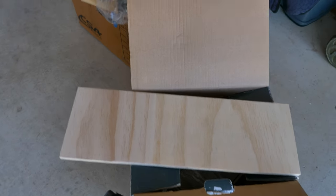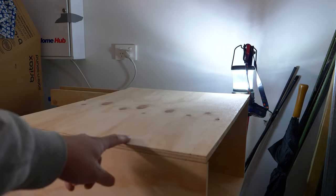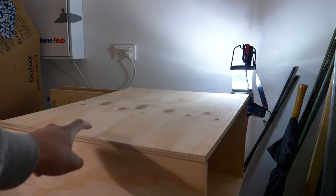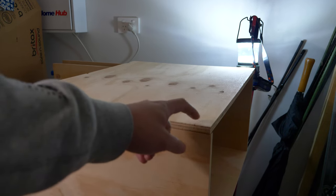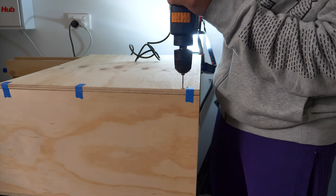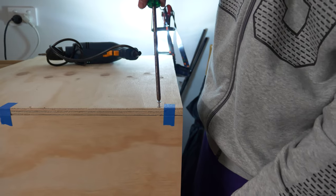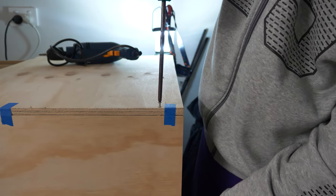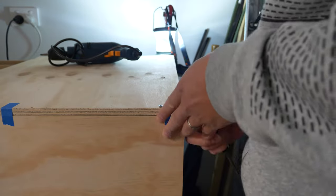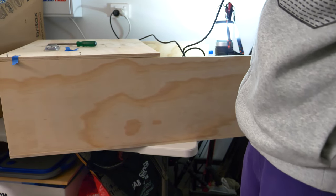I've got a few of my pieces here. Now we're going to put the bottom part of the box so that I can install dual batteries underneath and through the hole here. I'll pre-drill holes first and then screw them on. I'm using the screwdriver handheld so it can go straight. I'm also drilling some countersink so that it's flush when I do the screw.